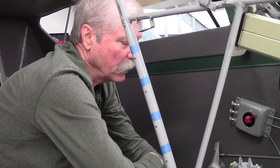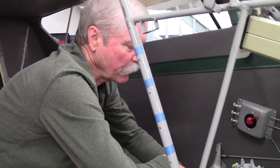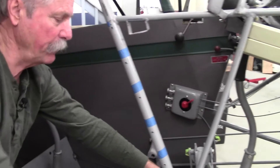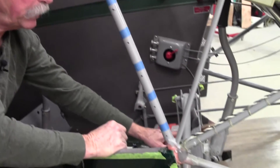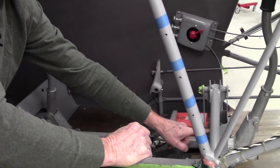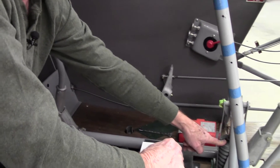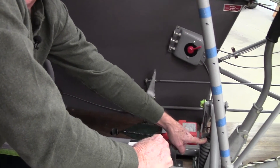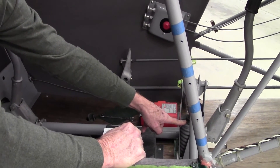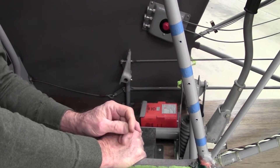Many of these units run low on oil, and there is a little oil fill cap up on the top of the stirrup here that can be used for access. You might check on that. But by and large, as long as the unit is clean and the piston isn't galled or shows signs of excessive wear, it's probably okay. It's a major effort to try to get the thing out of there, so if it's not showing any distress, it's more than likely doing quite well.